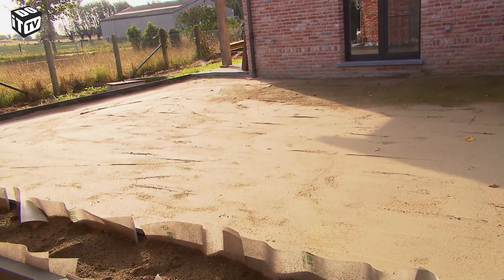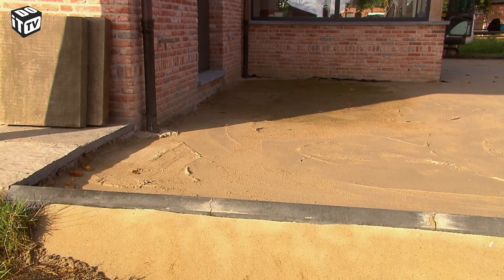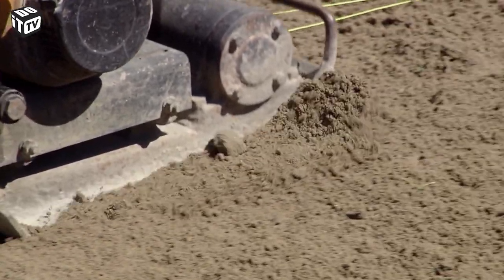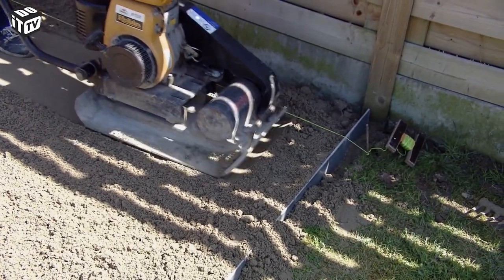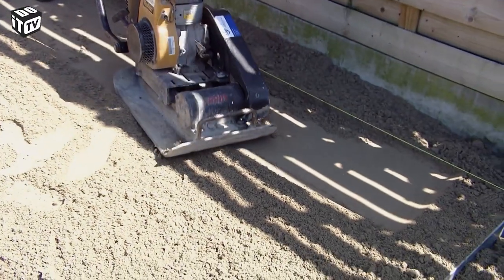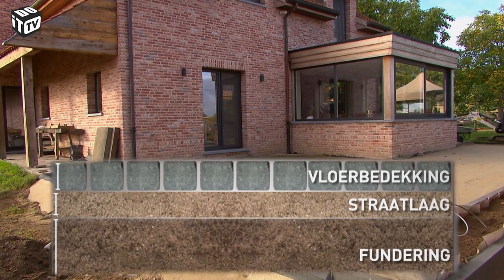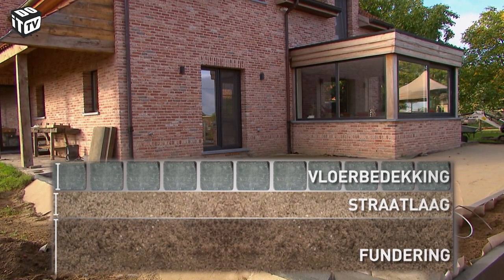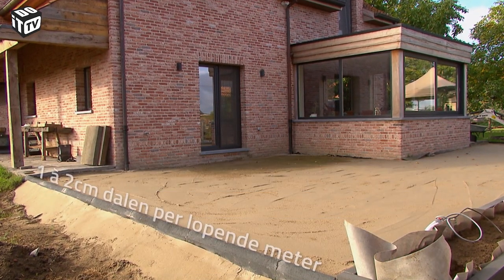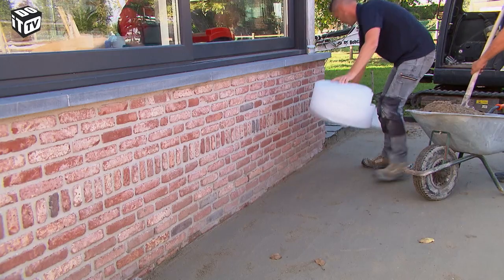The construction of your foundation depends on the load that will come on it. Here, a layer of 10-centimeter stabilized sand has been placed. With these tiles, you could also have chosen a foundation in breaker sand or split. The most important thing is that the foundation drains well. Therefore, use a maximum of 150 kilos of cement per cubic meter of stabilisé. We kept our foundation slightly below the curb stones to allow room for a layer of street material a few centimeters thick and our tiles that are precisely 4 centimeters high. The slope was carefully maintained, specifically designed to ensure correct drainage for the terrace.